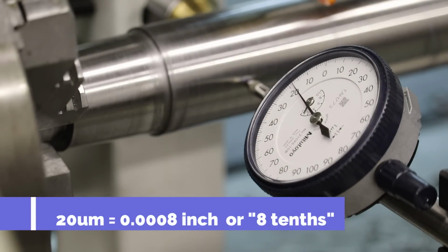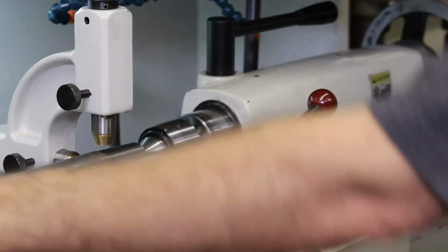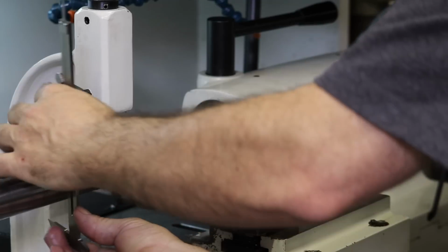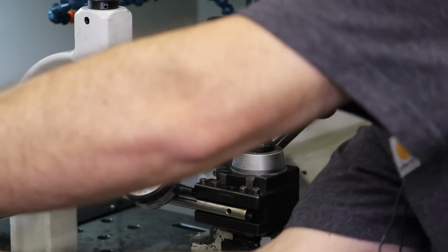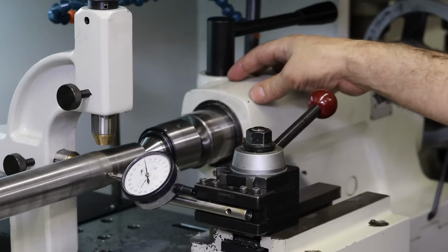So if I get the calipers out, or better yet, the micrometer. I'm miking out the diameter at the tailstock off camera. But at least we fixed our out of round, but it seems like we've got a cone. We've imparted a cone shape now into our shaft. Let me confirm that with calipers. All right, I measured the diameter run out from the chuck down to the tailstock, or the cylindricity, I think. And we are basically 4 thousandths smaller out here, 481, than we are at the chuck, 485. So with adding this follow rest, my dialing in of the tailstock is no longer valid.